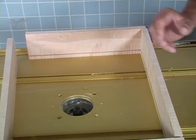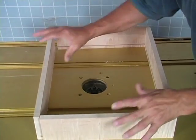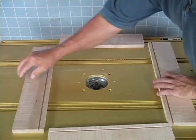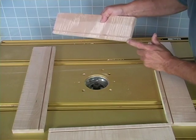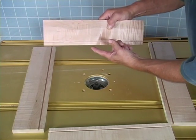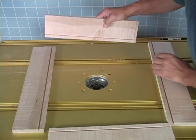So it's very easy to arrive at the dimensions of your drawer. Next, we have to establish the inside of the drawer, and you can see we've done that simply by cutting the dado for the floor ahead of time. When you cut that dado, always cut it about a quarter of an inch deep or halfway through the thickness of the stock. From the bottom of the floor to the top of the dado, we want about a half inch.